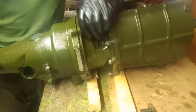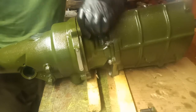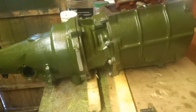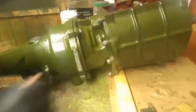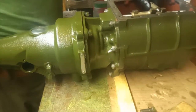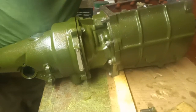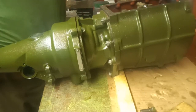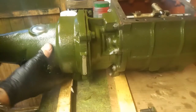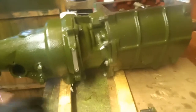Before I put the solenoid and things on I've obviously got to test them, so I'll need some help because my expertise in that department is zero. That's loosely put together now. It's a bit clanky because the reverse side was catching, and these forks are in just loose because I wanted to tighten the bench up. But she turns freely — something's just caught while I've been jiggling it; one of the synchro rings is probably not lined up. I'm quite happy that it's turning freely — the overdrive unit is fully built up now.